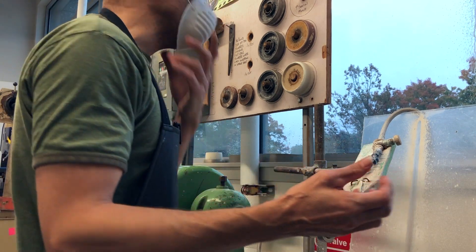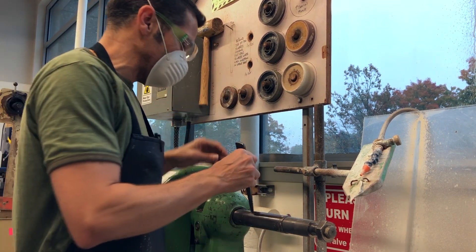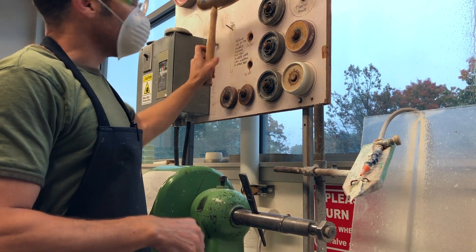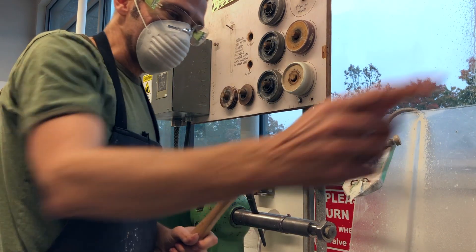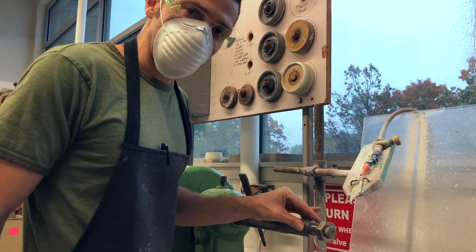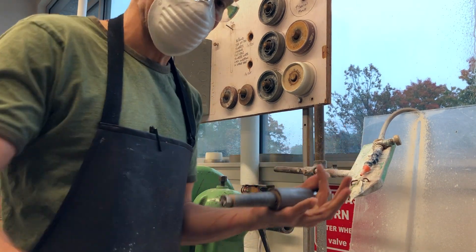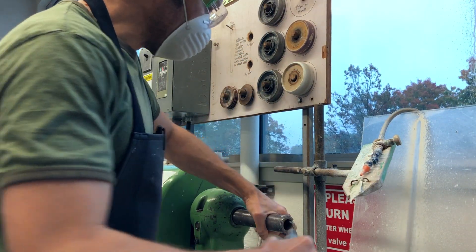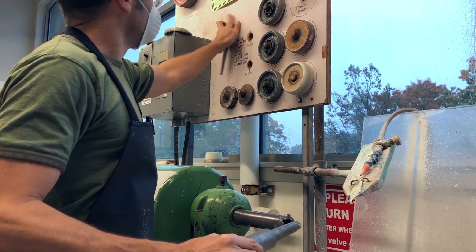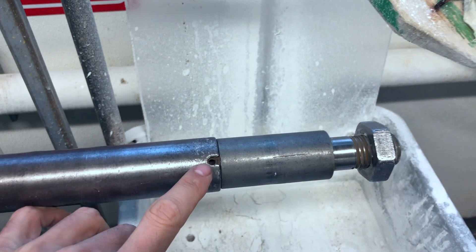Taking it apart is really simple. I have this pin — the round part faces the machine. Put that in, take a little wooden hammer, and always hold on to the arbor. I don't want to hit this and shoot it across the room because if it gets bent, it's several hundred dollars for a new arbor. A light tap and it comes right out. Then the little hole lines up with the little groove — make sure they're perfectly lined up and jam them in. Here is what it should look like after that.